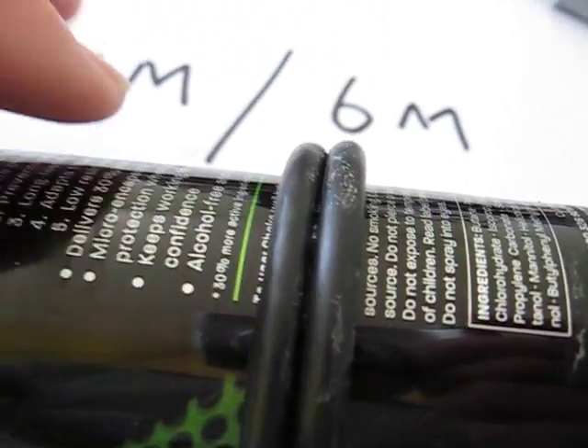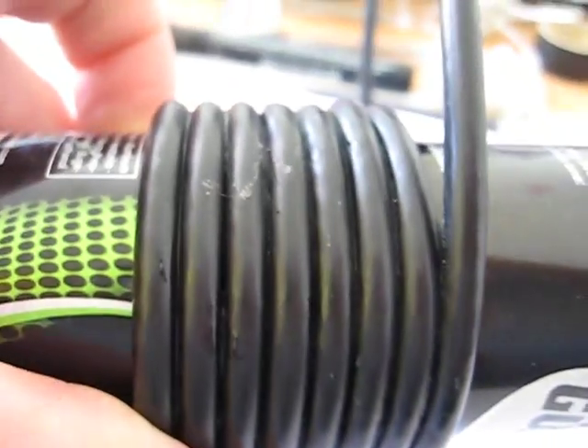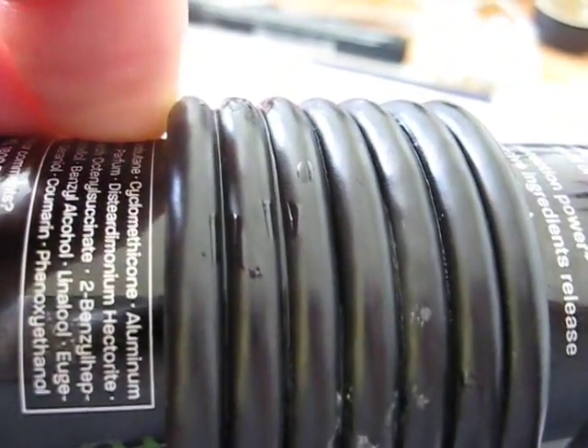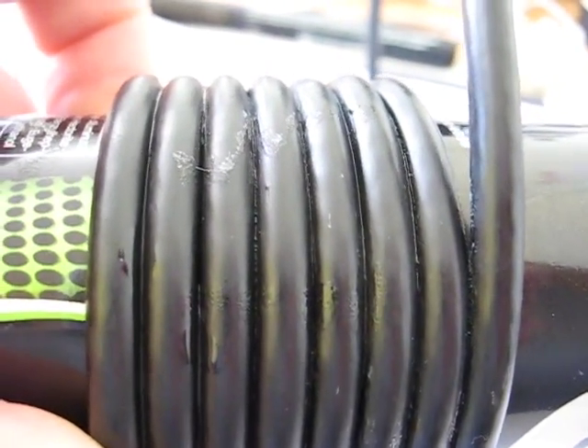Time to wind. I've got loads of coax on the end of this, so I don't really want to be winding the coax and holding the can. The can needs to be wound onto the coax - just hold the coax taut, don't twist it. Maybe only put a few turns on at a time, then you haven't got a mega lot to hold, especially with slow-acting glue. Just blob it in the gaps and put a bit of pressure on with your hands. That's two, four, six, eight - three more to go.